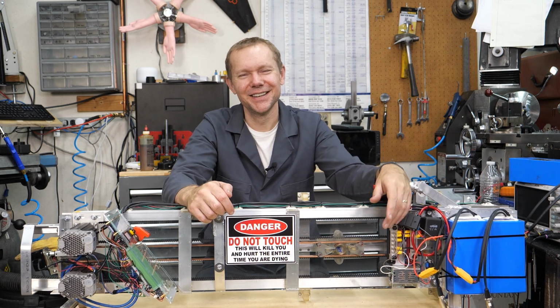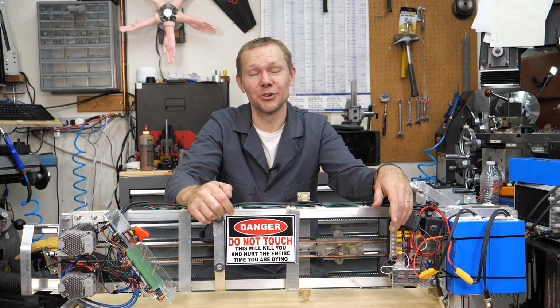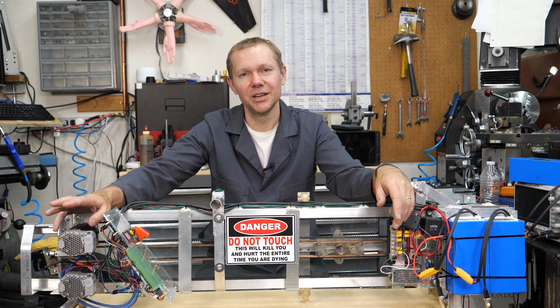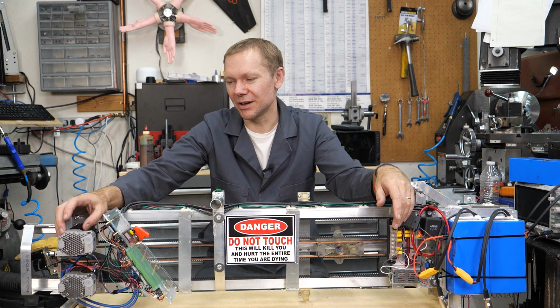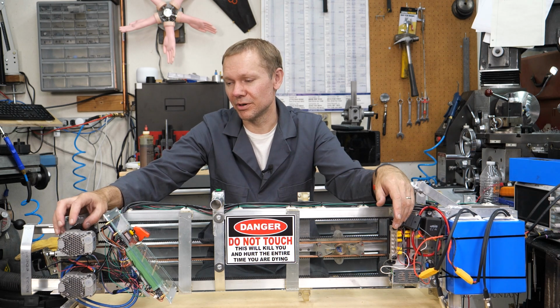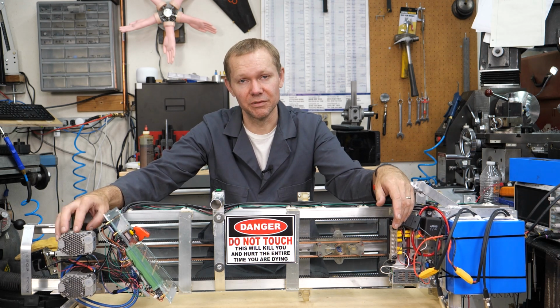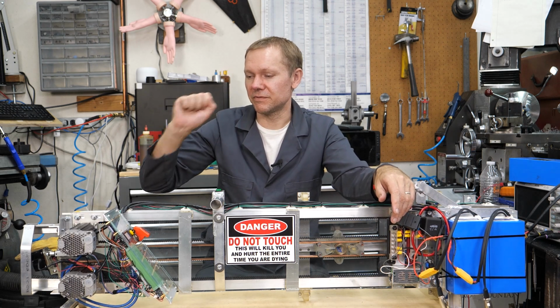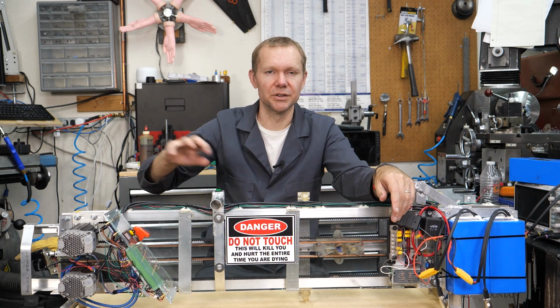Boy, that was kind of a pain. I didn't know from the beginning, especially with a stepper motor configuration, and these motors do have position feedback internally, but in this stepper motor step and direction configuration that I bought, you're just feeding it step and direction pulses of where to go.